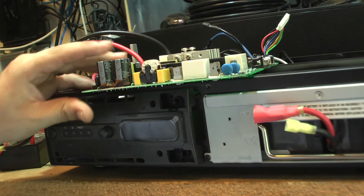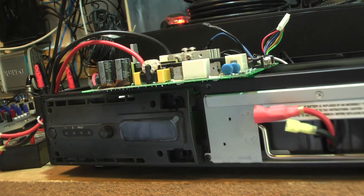Unfortunately, it turns out that I don't have any 68 µF 250 volt capacitors anywhere. With it not being my piece of equipment, I really don't want to take the liberty of putting something that's not the recommended spec in it. So I guess this is going to be part one of this video, and I will try to get my hands on some up-to-spec capacitors and we will look into that in part two.